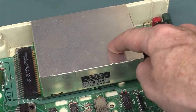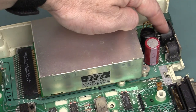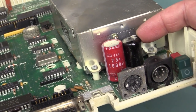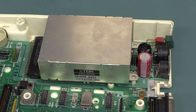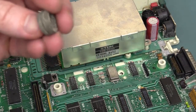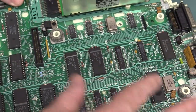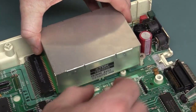All we've really got left to look at is this brick — this nice big shielded brick. TDK — dead giveaway. That's a DC-to-DC converter. Here's our DC input from our linear plug pack. This looks like a melted capacitor on the top but it's not — it's just a big wire wound inductor, a big choke. And then we've just got a big mains input filter cap — Nippon Chemicon, thank you very much. I really like how they've got the card edge connector here, completely separate shield and enclosure. Along with those EMI gaskets going up to the floppy drive, they took EMI reasonably seriously. They've done a pretty decent job there.